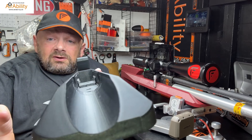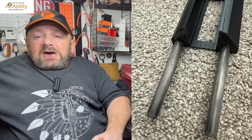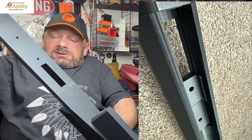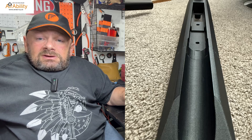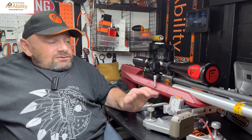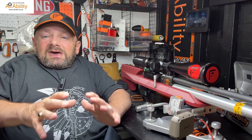As you've noticed, there's no aluminium core — that was one of our big breakthroughs. We then moved on to using carbon rods. Inside the design we've left a long thin 10-millimetre-wide void all the way up the stock, and we put two carbon rods in and glued them into place when we glued the three pieces of the stock together. It is incredibly strong — it doesn't flex at all. You wouldn't believe how good these plastic stocks turned out for rigidity and strength. We've now met our goal: stable bench rest rifles in both light rifle and 25-meter air rifle class for bench rest.